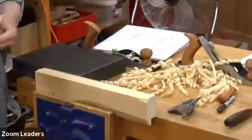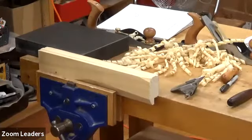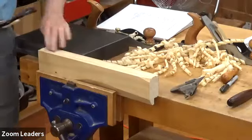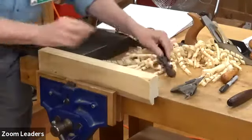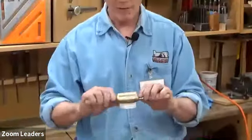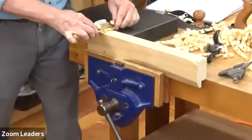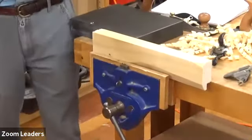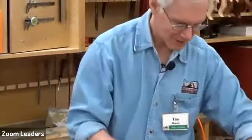It cuts well, kind of a heavy cut, but that's because this is my heavy one. I have a finish one. Although I think the wood goes the other way, really. We have some outstanding spoke shaves here. This is a finish shave. It has a very, very tight mouth, wonderful blade. It won't take a big cut. It won't get through your work very quickly, but it's a joy to use. That's, you know, 0.003 of an inch or something.